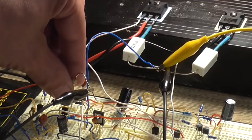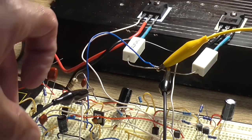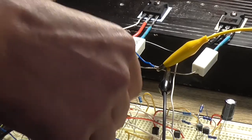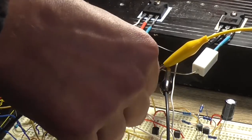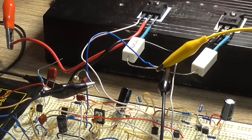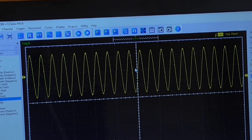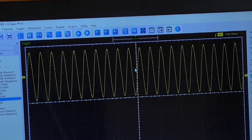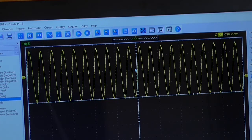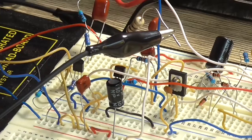But, well, it's not getting hot to the touch anymore. I don't know what the hell happened there, unless the end of that resistor was shorting on something it shouldn't have been, which is all very possible. I might have been shorting the capacitor out, I don't know. Anyway, that's stabilised our output again, so it's not oscillating. So I'll put it back to 1.8 and look for smoke. No smoke, so no, not getting hot now.